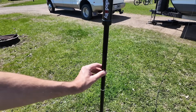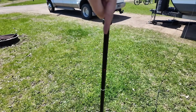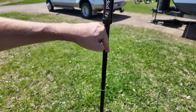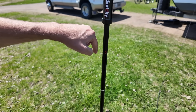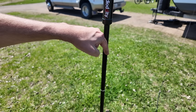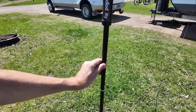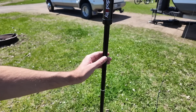At the bottom, you're tapping the very bottom wire of the coil and then you use the entire coil going all the way up as part of your antenna. When you move this up to the top, you're bypassing all of the coil and tapping into just the top — maybe a quarter of a turn or a half a turn. So very little of the coil versus all of the coil, and in the middle is half the coil. I'm going to go somewhere on 20, which I'm going to guess is somewhere around there, but we'll find out. She's all set up — that was pretty easy.